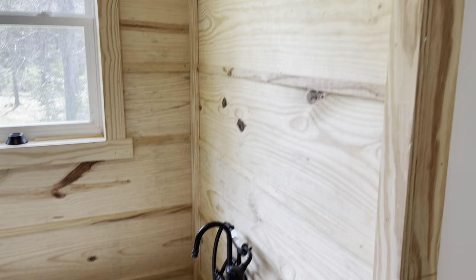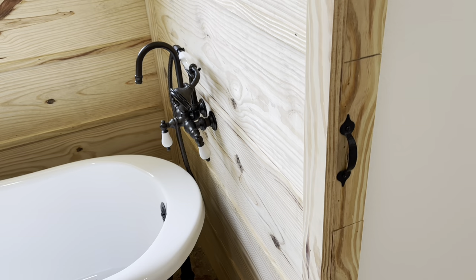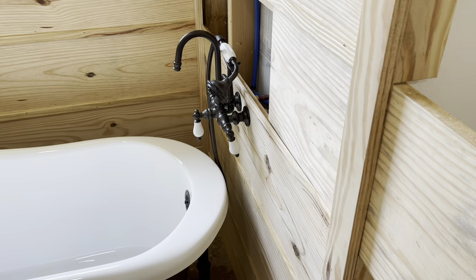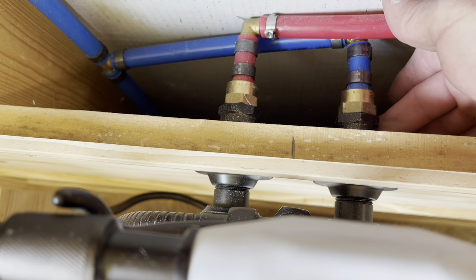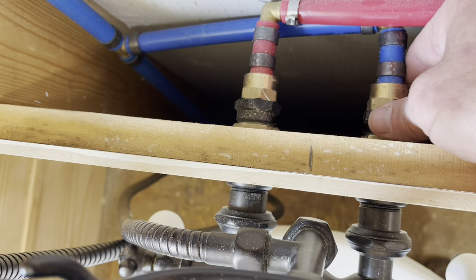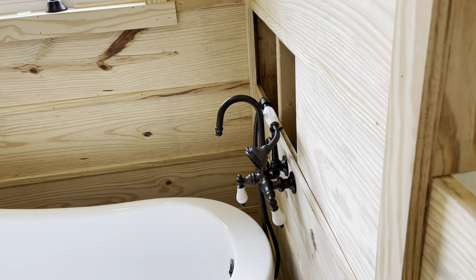I was talking about not trusting the gaskets on the backside of that mixing valve, so I put a handle right here. I just cut that trim right there, and that way when I get ready to work on it or look at it, I can just pull that panel to the side. I can check everything and make sure those rubber gaskets aren't leaking — because it's almost like a washing machine hookup. I just don't trust that. I like to be able to see it, check it, and make sure everything's good. Then close it right back up — just that easy, nothing to it.